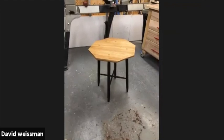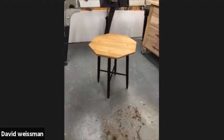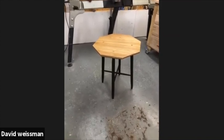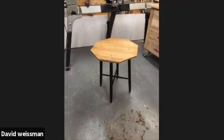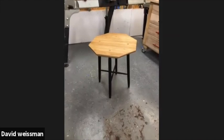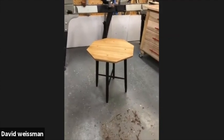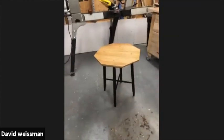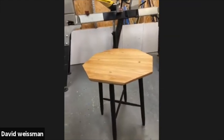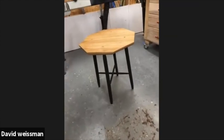Paul is my hand tool guru. We bonded last year when I was in San Diego, and a year ago I clipped the design for this table out of Fine Woodworking magazine and put it aside — I knew I wanted to make it. After Paul's last session where he taught us how to hand-carve octagons on legs, I said okay, it's time to pull this out. The basics of this table: the legs are ash, chosen because it's very straight grain. The top is hickory made up of three pieces put together. The top is cut in an octagon and then beveled at 45 degrees on the sides, with about a three-quarter-inch straight lip and then 45 degrees underneath.